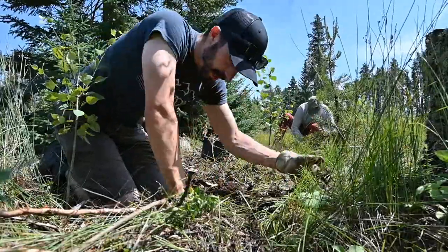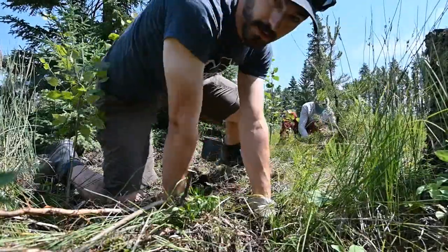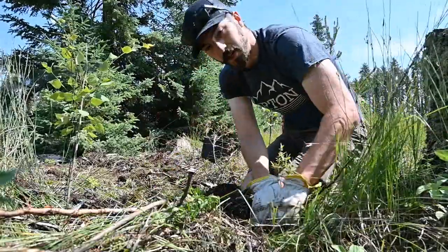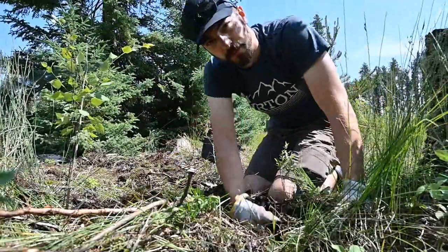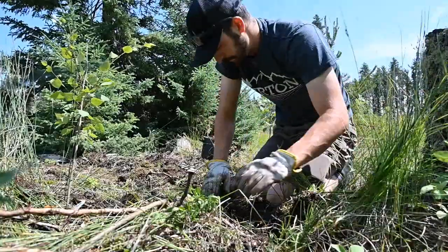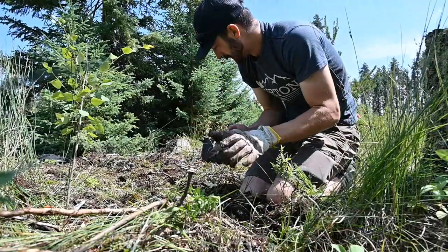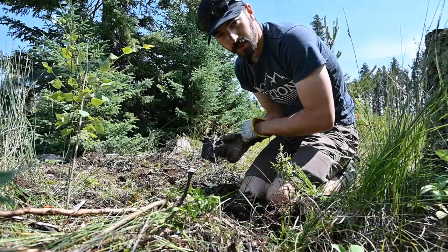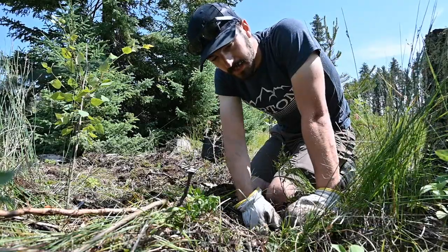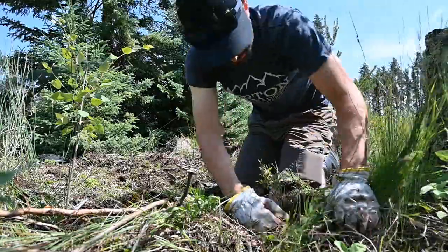As you guys can see, we're gathering some spruce roots today. That's what we're going to use for basically all the lashings on the canoe. That's what I used for spruce bark baskets or birch bark baskets. I'm looking for root about pinky size, and we're going to have to boil them, take the bark off, and then split them to get the good cordage or lashing material.